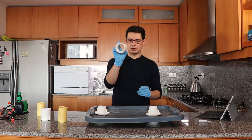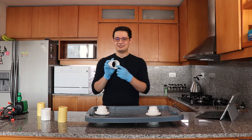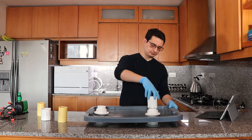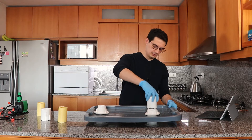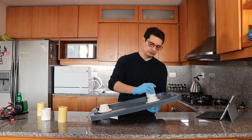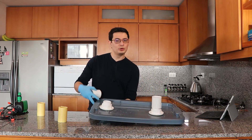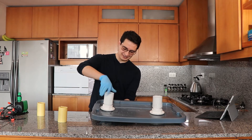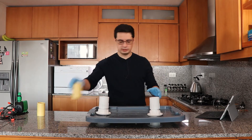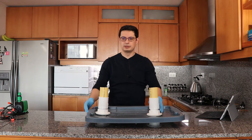I have these, which we call female adapters. We have this adapter that goes on top of this flange so we can screw it on top. You need to get the thread right, and then you screw it in while holding the other side, because if you keep screwing without holding, you uncouple the other one. So now these two are hooked, and from here we can actually start with the PVC setup — putting all our PVC pieces together, building from here up to the top.